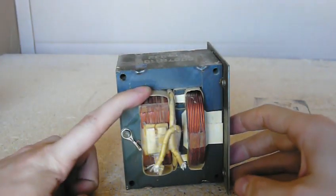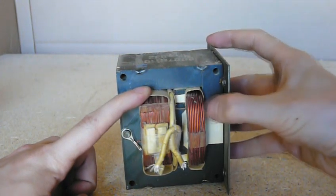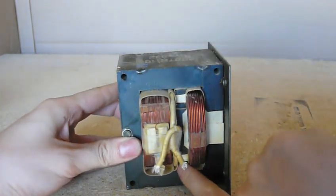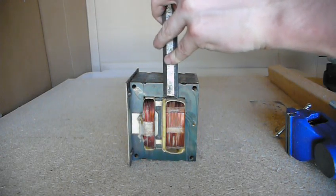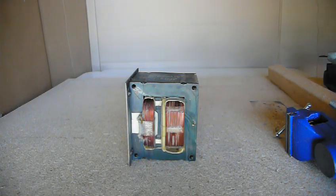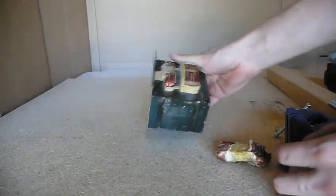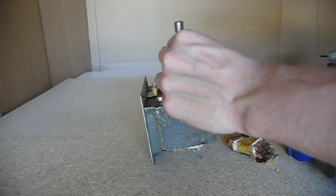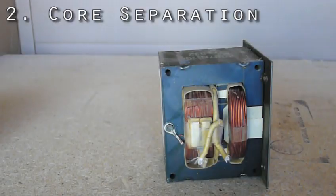Just to review what's inside a transformer: we have a secondary made of very thin wire, a primary made of thick wire, a few turns of some other wire, and some magnetic shunts at the top and bottom. Now, the way everyone else does this — which I think is the much tougher way — is they take a chisel, hammer off the secondary, and then use a punch to punch out the coils, leaving an empty transformer that you then thread your new secondary through back and forth every single time. I don't like that method.